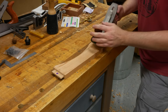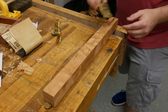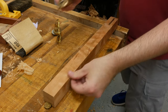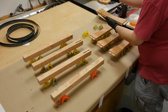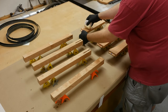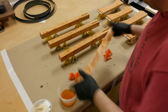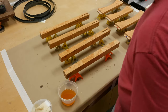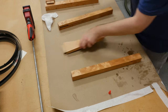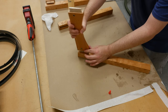The rough edge is cleaned up using a round-bottom spokeshave, followed by some sandpaper. Like with the legs, I get the aprons finish-ready using my number four plane. When the opportunity presents itself, I like to pre-finish as often as I can. For the base, I wiped on four coats of a wiping varnish and sanded between coats using 400-grit sandpaper. The glue-up for the base is done in two steps: I glue an apron with two legs to create two frames, and then once that glue dries, I finish gluing up the base by bringing those two sections together.